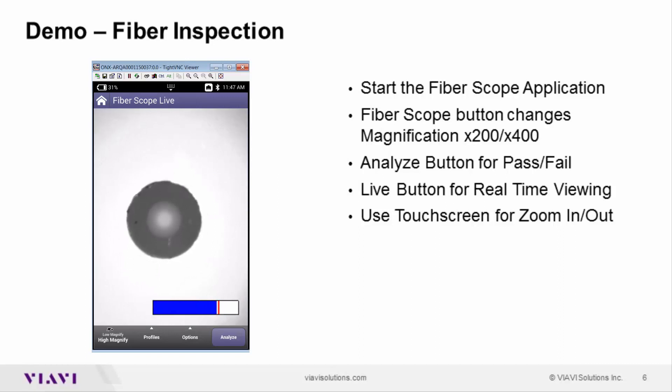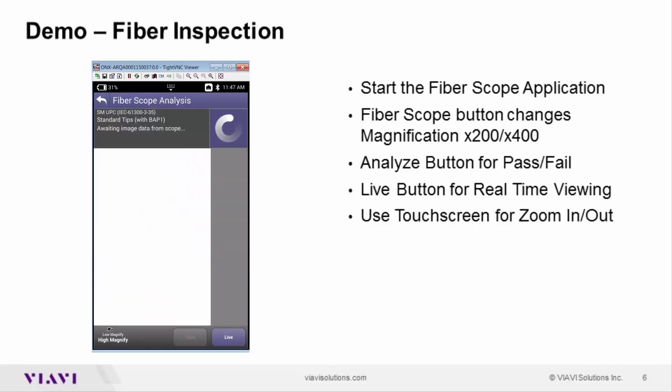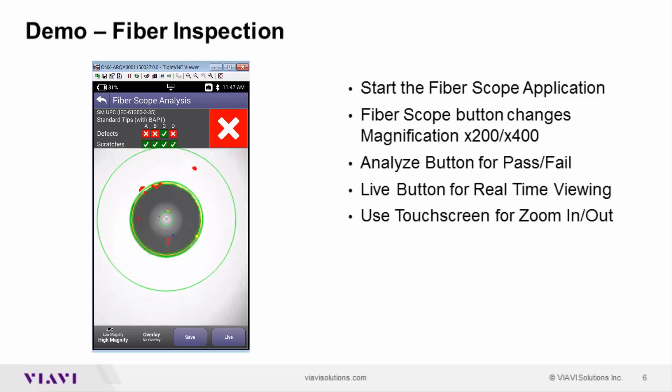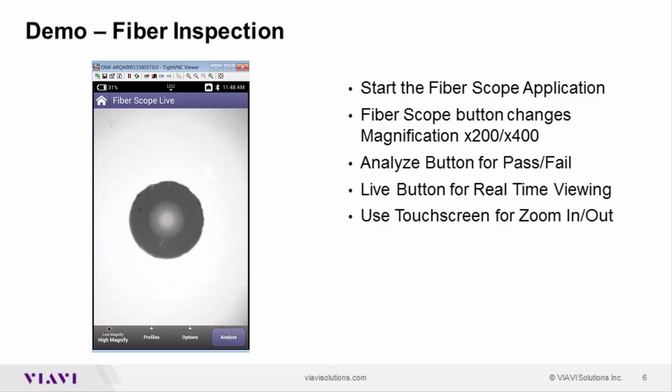It appears to be much cleaner here, but doing an analyze gives us a second opinion. The defects — the physical imperfections in the end of the fiber edge — have not moved. The scratches, their locations, and the like have not moved. It's really the hard imperfections we have in the different areas listed as A, B, and D. The core itself appears to be okay except for a minor imperfection on the outside of the core. But when the cladding has issues it will not focus light back into the core, which would mean high loss in this particular fiber jumper. The live view is available in either 200 or 400 times magnification.